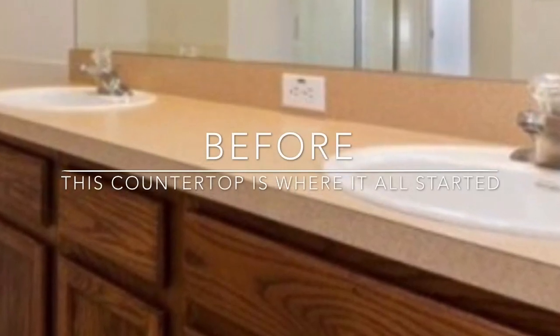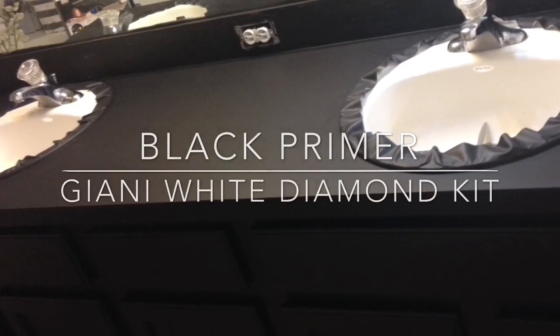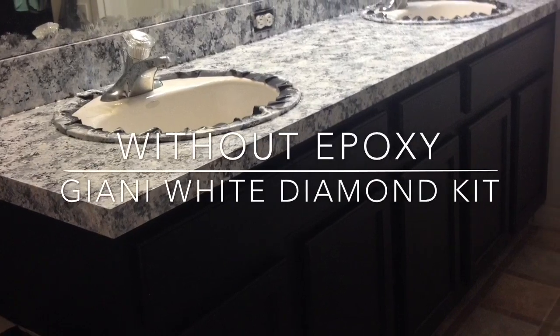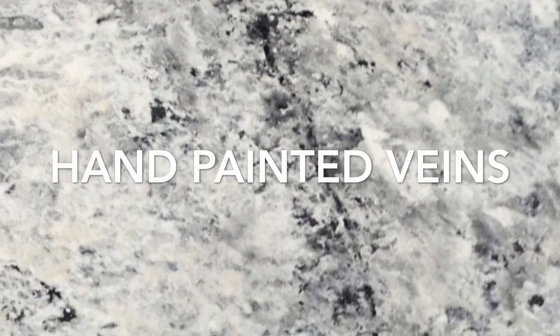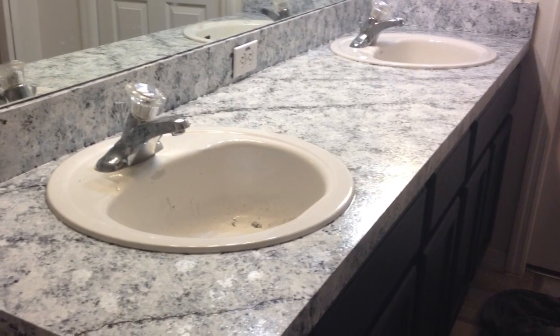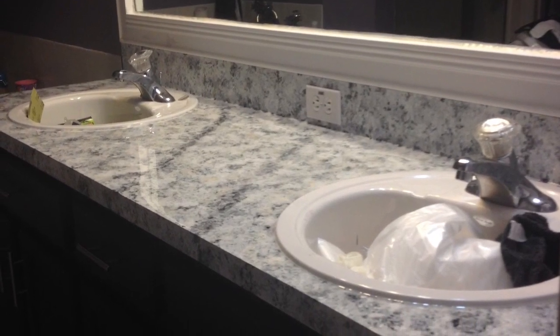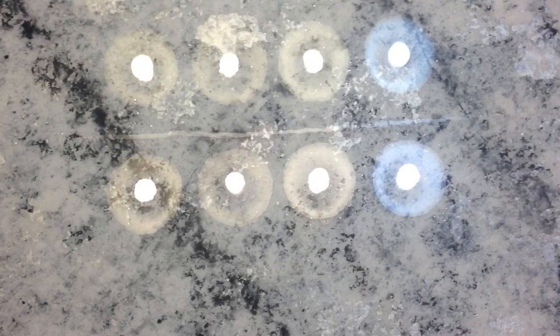These are the countertops that we painted and used epoxy on top of. Originally it was this peach Formica. We used the Gianni Granite White Diamond Kit — there's a black primer that comes with it, and I followed the steps. After adding all of the veins and all that hard work, I didn't want it to get messed up, so we decided to go with epoxy. After we saw the results, the shine, and the resilience it gave us, we knew this was the product we'd be using throughout the rest of our renovations.